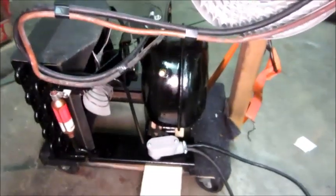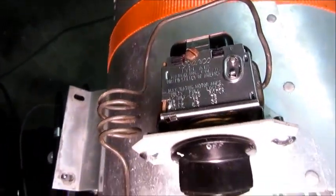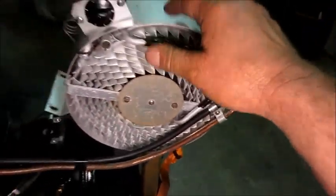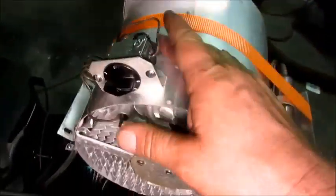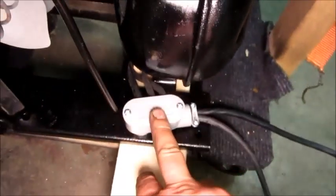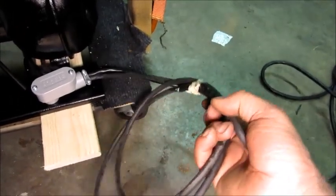Bad news aside, this is I believe ready for charging. The thermostat I put in the sonic cleaner with the cover off and cleaned it internally, lubricated it, got it all ready to go - works nicely. Have the thermostat cap tube arranged and put in there. Have a new cable going into the inside of this evaporator - that takes care of the thermostat and the evaporator motor. Put this little junction block on for the incoming power, and this cable is going to go to the door for the power for the coin box.